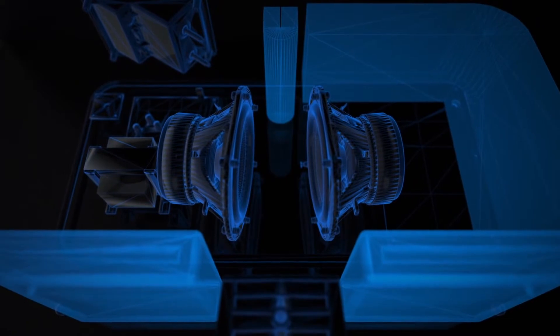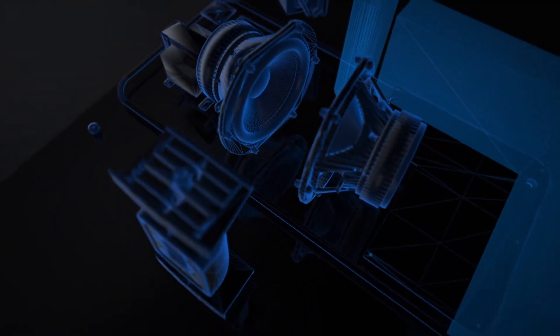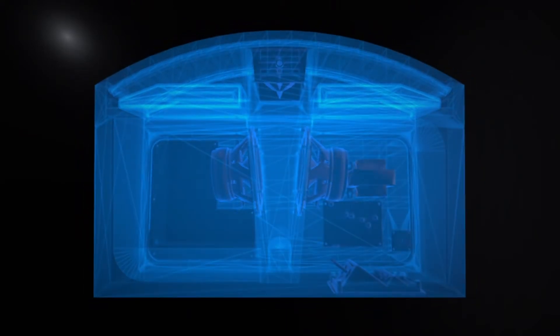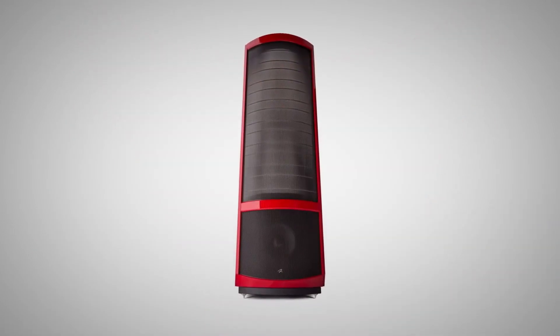They provide a really clean sound and give some vertical control of the dispersion. We've got a unique woofer design to fit in the small space — we had to turn the woofers to face each other and fire out through a slot where the bass section comes out through and around the tweeter and through the middle of the two ESL panels. We were able to create a coherent sound from the woofer to the panel to the tweeter, and it all blended together very nicely. One thing that's unique to the ElectroMotion line is that these products are worked on by the same team that worked on our Neolith, which is our higher-end ultra-performance electrostatic loudspeaker.